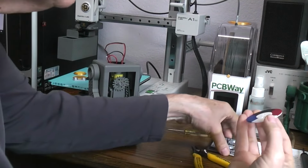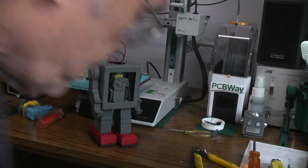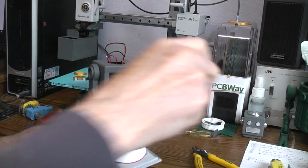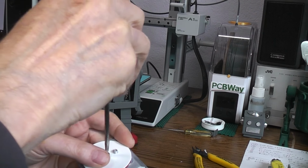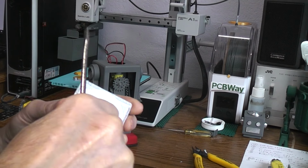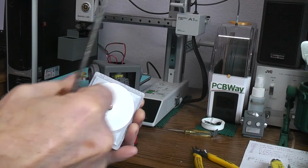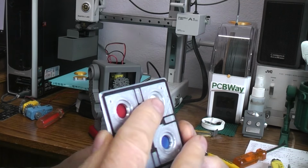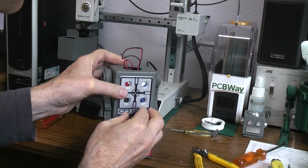We have to quickly reassemble this because I took it apart, but that's just one screw. And again, we want to make sure the screw's in as far as it can go, but we still need the disc to turn freely. I think we're all right. Notice how the disc sticks up just a little above the top of this. When you go to put this on the body, horseshoe the top in first, and then drop the bottom side in.